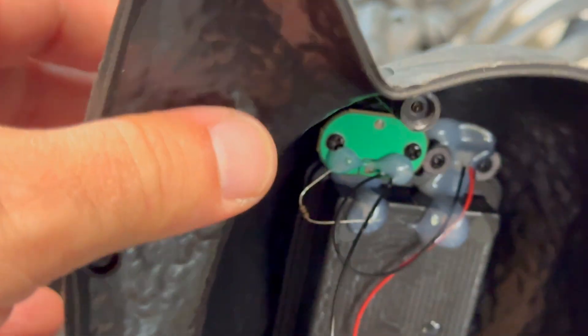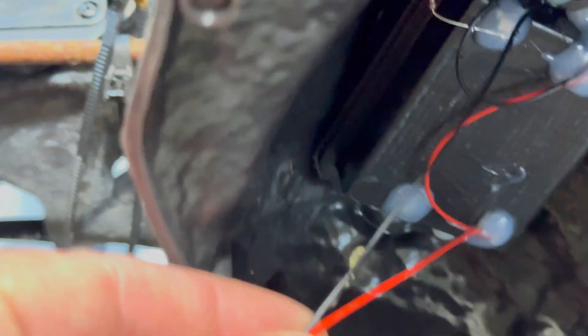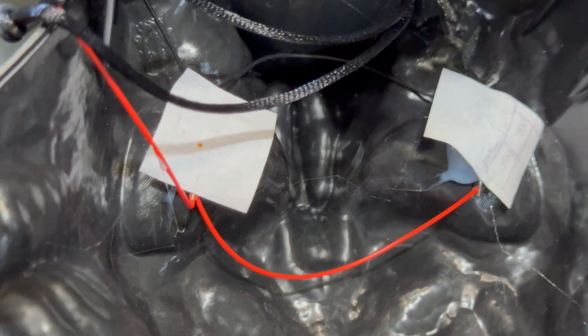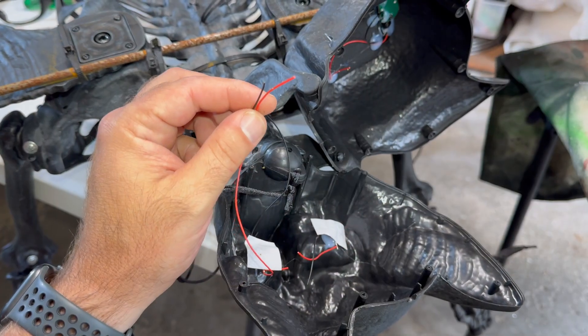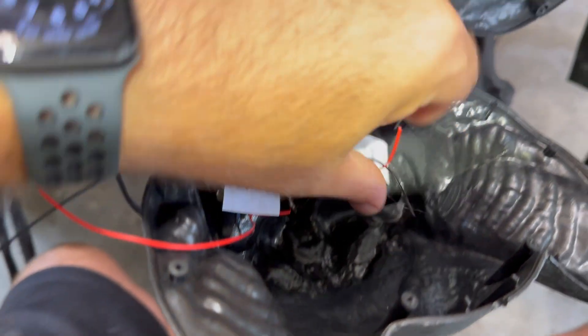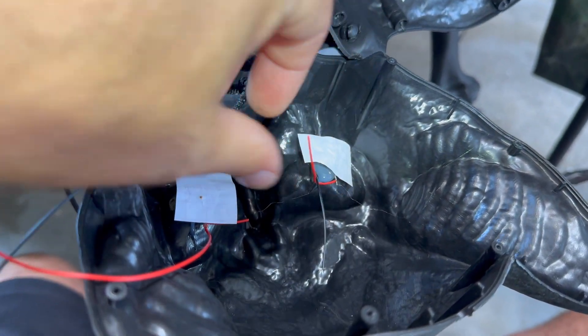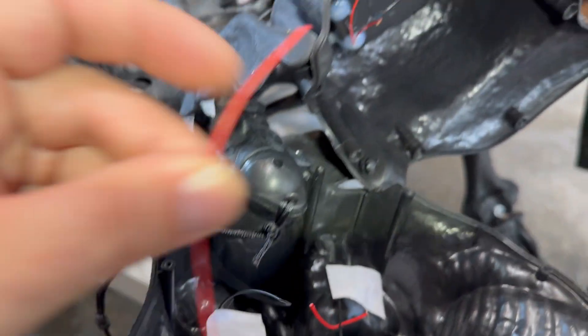You'll notice the red and black cables going from the original battery source. You're going to want to cut the long ones coming from the battery going to the eyes, and then cut the jumpers — the battery goes to one eye and then gets jumped over to the other eye. You're splicing four cables: two from the battery pack, and a red and black coming from one eye jumping over to the other. After cutting, you'll end up with two longer ones going to one eye and two shorter ones from the other, since the shorter ones were only used as a jumper.